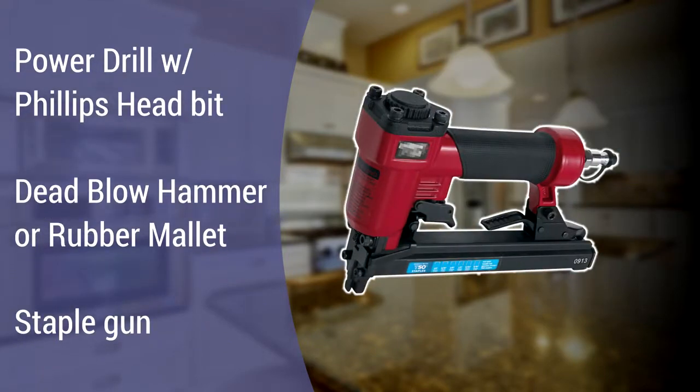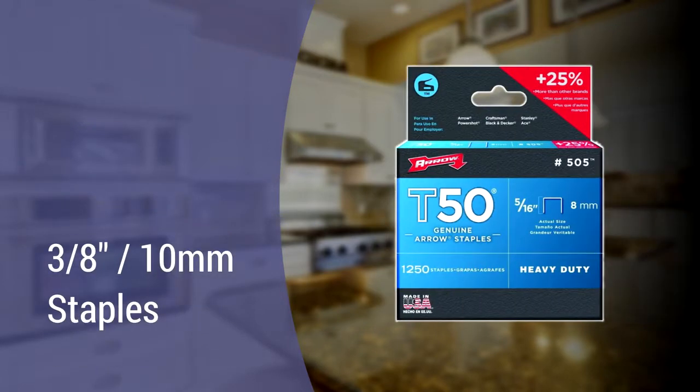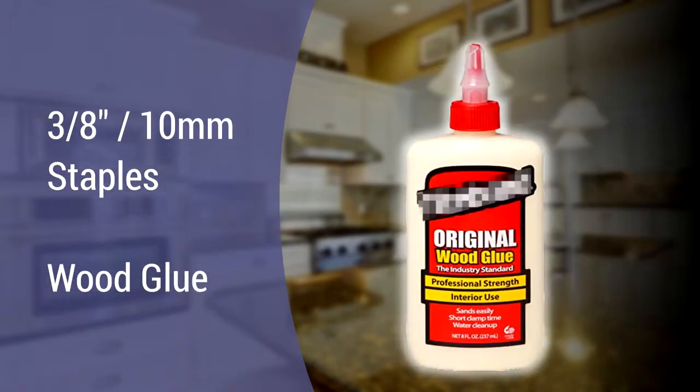While an air-powered pneumatic staple gun will make the job easier, you can also use an inexpensive manual staple gun. We tested the Arrow Model T50 heavy-duty staple gun with success, and this model can be found for under $20 at most hardware stores. You'll also need the appropriate 3/8 or 10mm staples for your staple gun, as well as a bottle of wood glue, which will form the primary bond that holds your cabinet together.